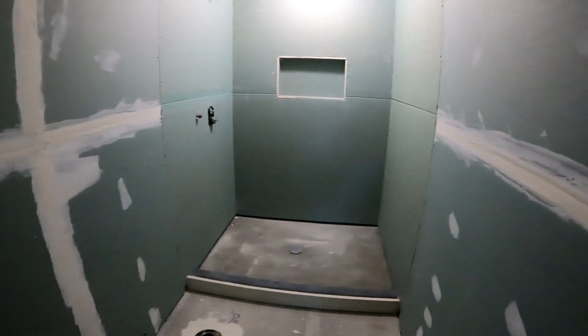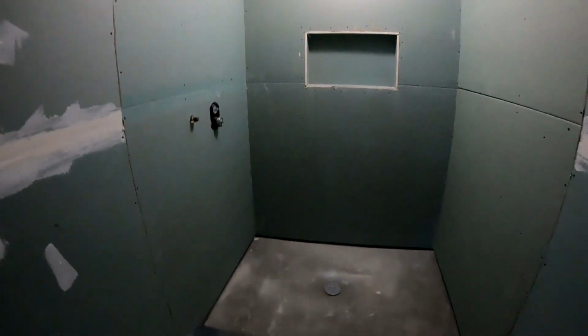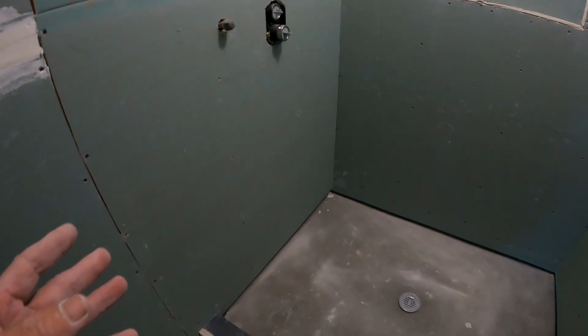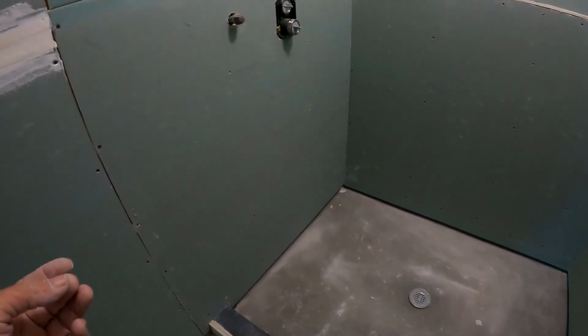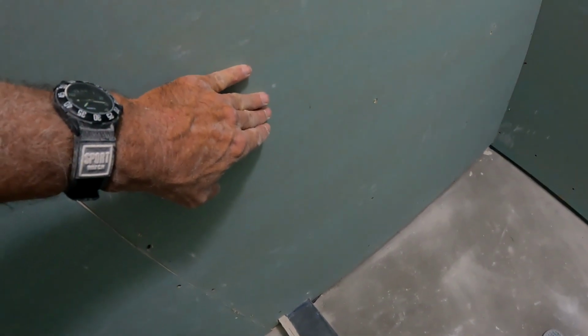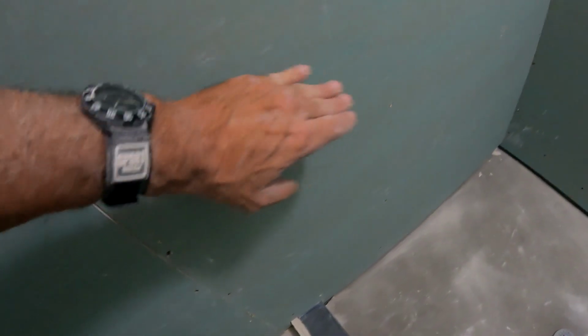For those of you who stumbled on my channel accidentally, don't know who I am, don't know how I build things, yes, I use sheetrock inside showers. The main reason I used Durarock for many years, probably 5 or 6 years: between the studs, 16 on center, I would push on the Durarock and it would flex. And I hated that. I need a solid surface.